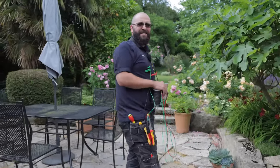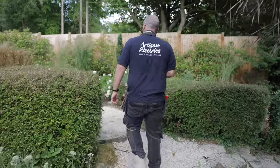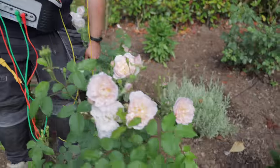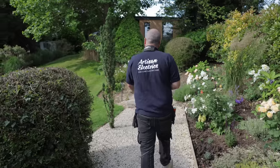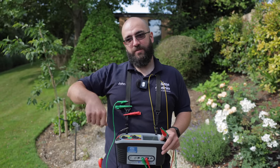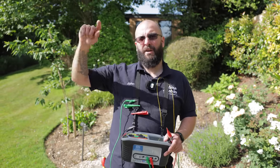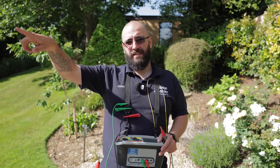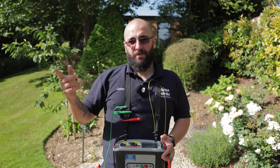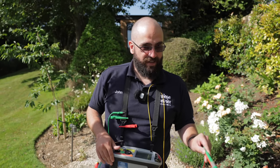I can see a junction box — it's a bit of wood, I thought it was just moss growing up the side. I wonder why the circuit was off. There might be a fault on them — when we turn them back on, because of the number of RCDs here, we could end up knocking out one of the house RCDs rather than the one closest to it because there's no selectivity. The customers are working from home so we're trying to work around not turning that circuit back on.